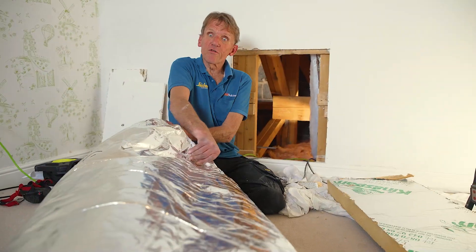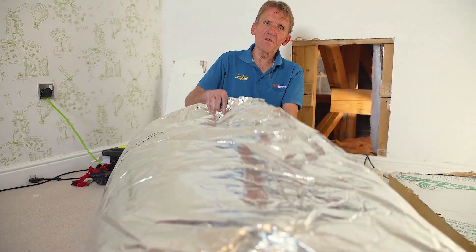So you've got a piece of insulation which is poorly fitted. Although you'll hear a lot of arguments about multifoils and superfoil — what it achieves and what it doesn't achieve in terms of U-value — the thing is you can't always get the insulation into the building that you require. If you're doing something like a conversion or an extension, because of the stringent requirements now for insulation, it's become a major cost and a major headache for a lot of people building and designing. It's well worth talking to Superfoil and seeing if their technical department can find a solution for you — it may be a mixture of two different types of insulation, or you may be able to achieve the whole thing with superfoil. Building inspectors will always look kindly on a job carried out properly: taking care of the details, taping those joints, making sure it fits, and not leaving all those little gaps which can undo a lot of hard work.